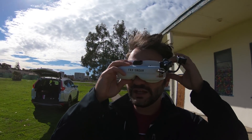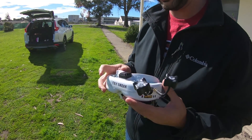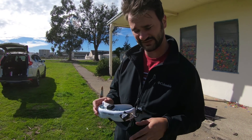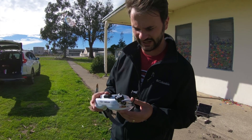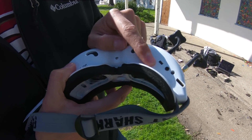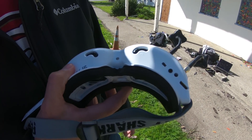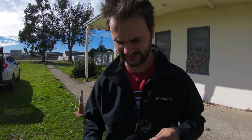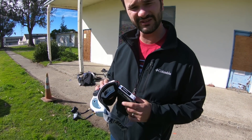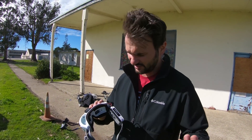Are you running the Clearview module? Yeah, I got the Clearview module with a couple of Triumphs on it. I was doing a quick check to make sure my DVR was outputting in color, because there's been an issue where if you have a DVR powered on when the Clearview is up showing its logo screen, it gets confused and thinks you're in PAL instead of NTSC. The fix is to shut it off when you turn on your goggles, set RX to zero, turn on your DVR, then turn the module back on. I heard there's a firmware fix coming soon. They find they drain the battery a little more than expected, but having a backup pack means that hasn't been an issue.